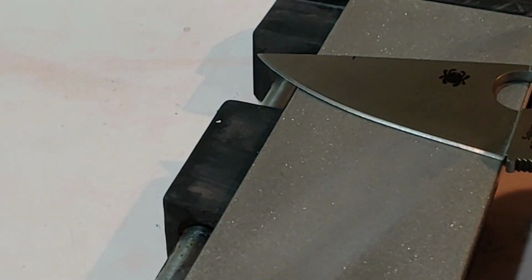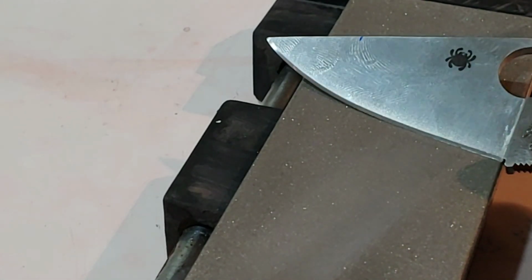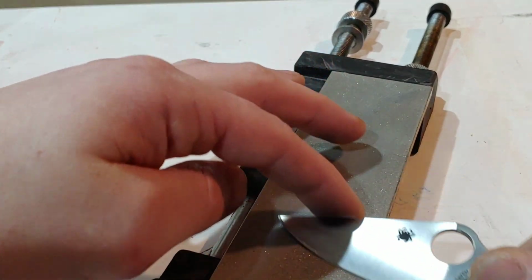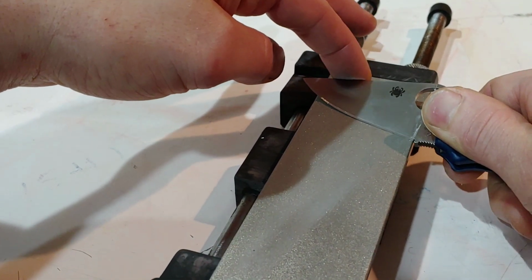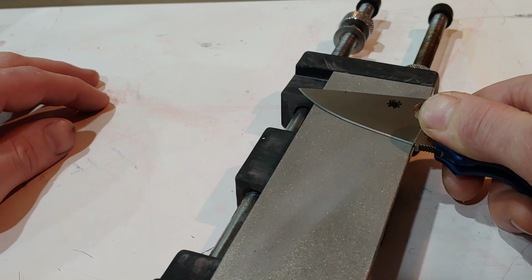And pay attention to the heel, right where I had the pen. It's there, it's gone. It's there, it's gone. Remember, the heel of the blade. And if you can hold that and slide it across the stone without rocking back and forth, holding it nice and upright, you will get a good angle, or be able to hold your angle.